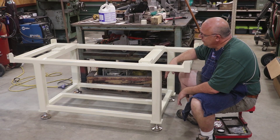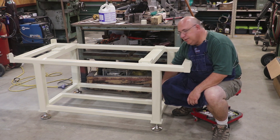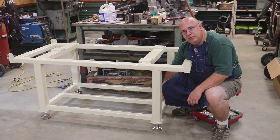In addition to the cross bracing on the bottom, I put a third cross brace in the middle. We put this in for a couple of reasons: first, because I'm planning on putting a shelf down here — either a piece of plywood or metal — and I was worried that with such a large area you could get some sag. So this was to give it some stability, just another piece going across there.